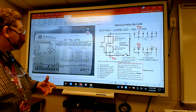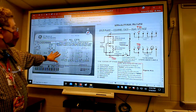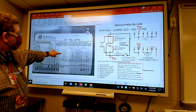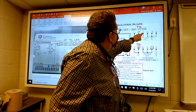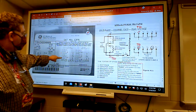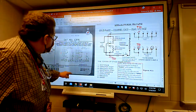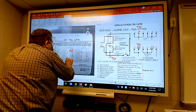On low voltage, you're going to connect T2, T4, and T10 together - that's black, yellow, white. Over here on the drawing T2, T4, and T10 are together - that's the same. Then we hook up blue, orange, red which are T1, T3, and T8. T1, T3, and T8 - it's the same configuration on both drawings.